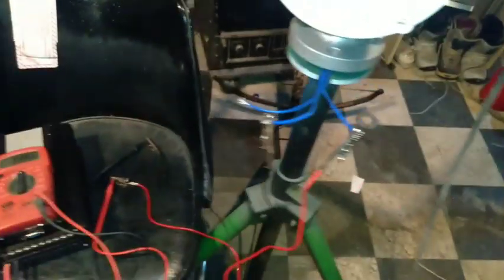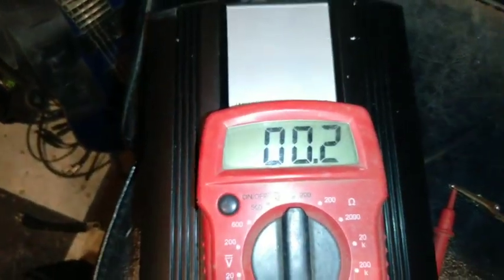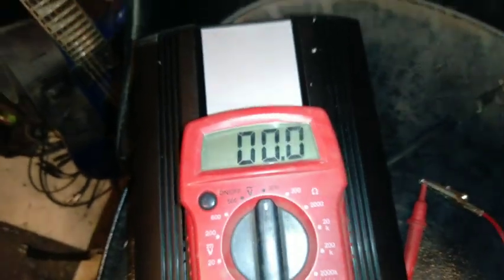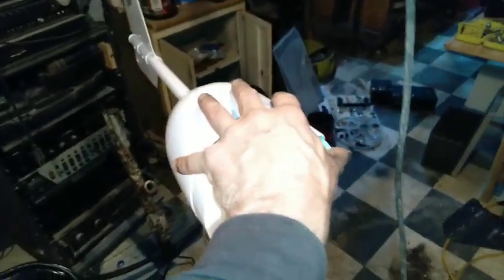This one should be right about 57 again. Perfect — I have nothing wrong with that. The bearing spins nice and smooth, and just with my hand I can make almost 16 volts. So the turbine itself, I think, is functioning perfectly fine.